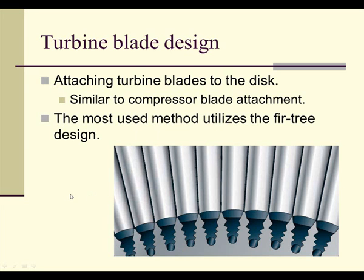Looking more closely at the turbine wheel and turbine disk assembly: if it is a multi-component assembly, meaning we have an individual disk and the blades are attached to it, when the blades are installed we want to make sure they're installed with some play. But we need to retain them — there needs to be some movement with the blades, but they have to be able to be retained.